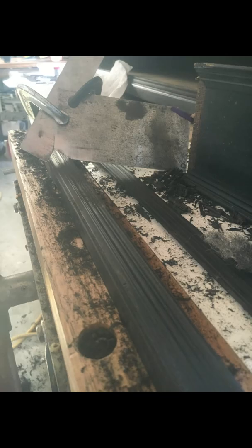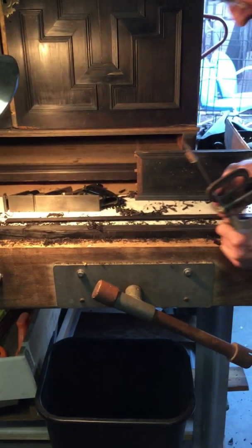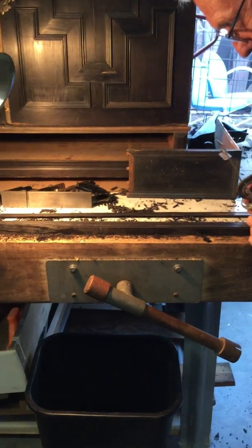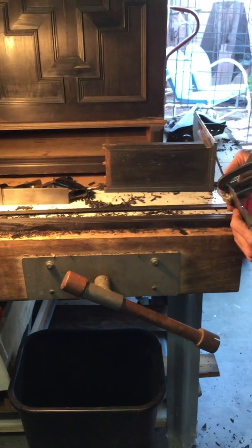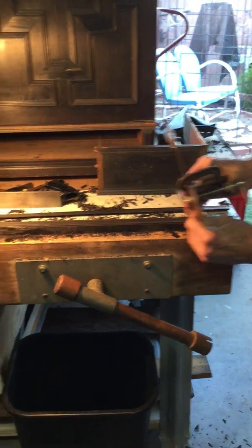In this next section, I'm going to show you a little bit about the veneer. This is some of the raw material I used, and I had some veneer and some solid stock. So I took a card scraper and I cut the profile of each of the veneers, and this is how it's shaped. Just with a carbon steel cutter. Actually, it's a chef's griddle scraper. And with some guides there made out of C-clamps. Just run it along there. I was actually making 2 sides at a time.